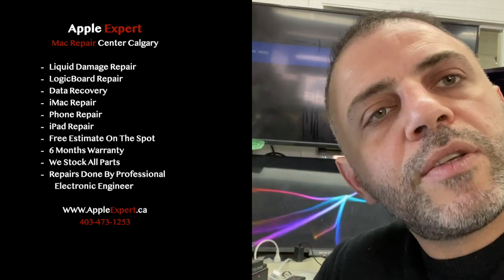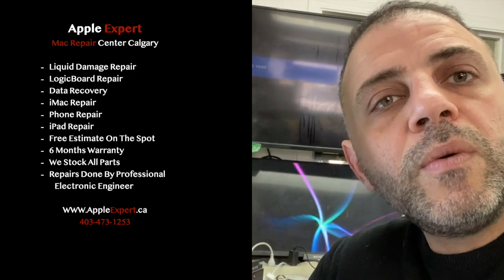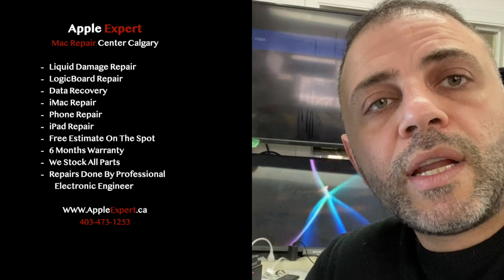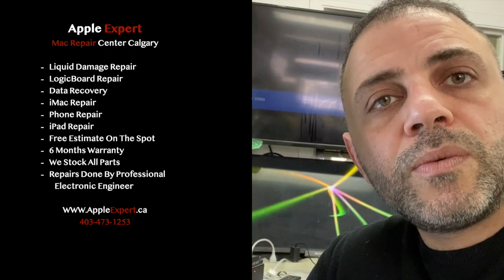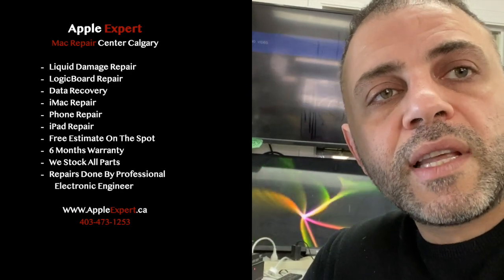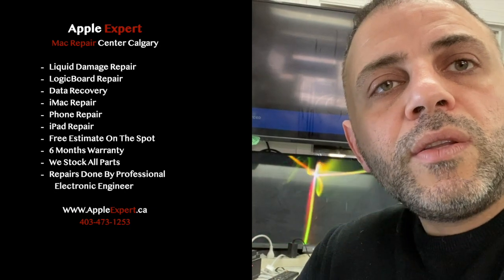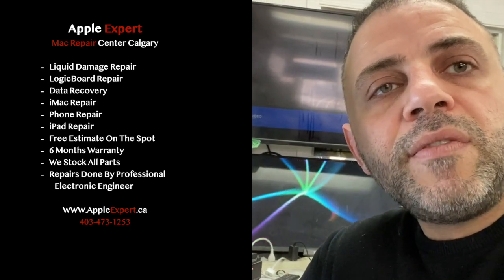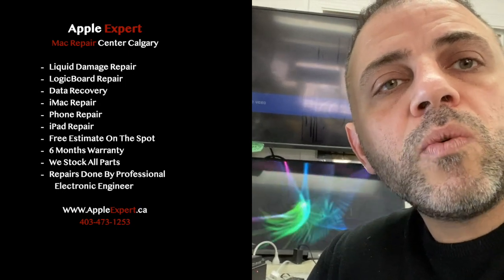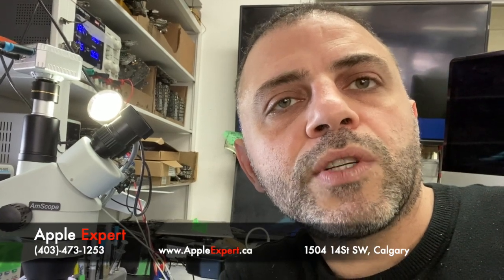If your laptop or device comes in contact with liquid, please, if you can, remove the back case, disconnect the battery, don't connect the charger, and bring it to a store where they can take it apart and check how severe the damage is. Because as soon as the liquid goes to the logic board, the laptop will not work. And even if it does, it will work temporarily or with problems, and the corrosion will get worse and worse. Everything is repairable, including liquid damage, logic boards.